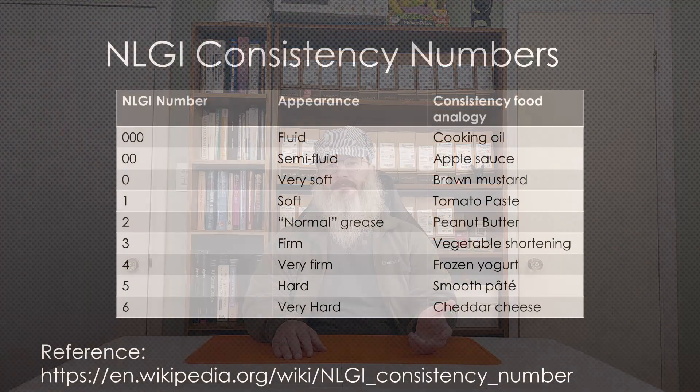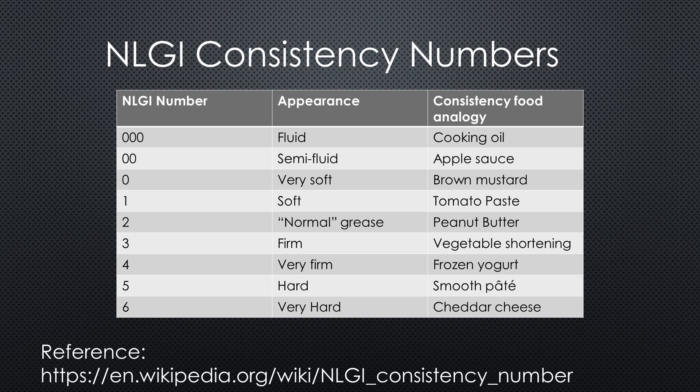You might be asking yourself, what does NLGI 1 even mean? Well, the NLGI rating, or more formally the NLGI consistency number, is a standardized classification of a lubricant's relative hardness. The standard was established by the National Lubricating Grease Institute and reproduced in independent ASTM, ASE, and ISO standards. There are nine different grades, or NLGI numbers, in the standard, ranging from 000 to 6, with 000 being the softest and 6 being the hardest. Using a lubricant with the correct NLGI value is important because if grease is too stiff, it might not flow into the areas needing lubrication. But if the grease is too soft, it might leak out of the bearing or wash away if water is present. NLGI 0 through NLGI 2 are often recommended for linear rails used in consumer grade 3D printers. Given the relatively low loads and forces in a 3D printer, any grease within that range should probably work.